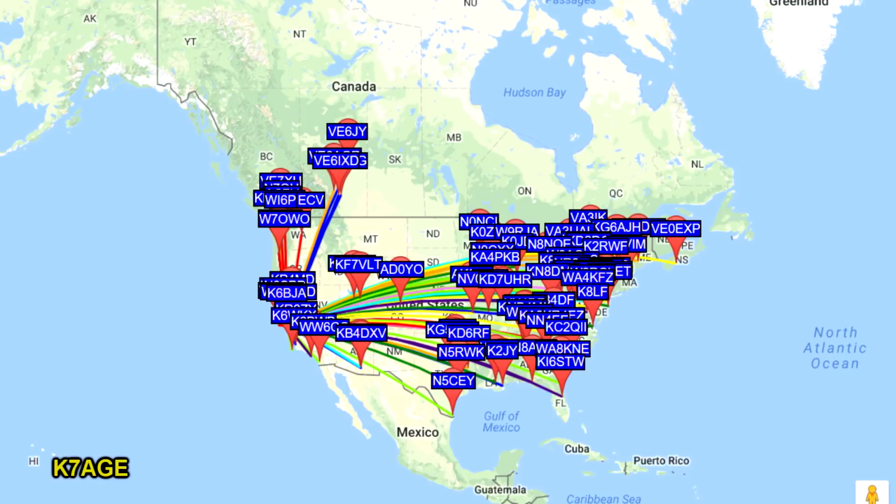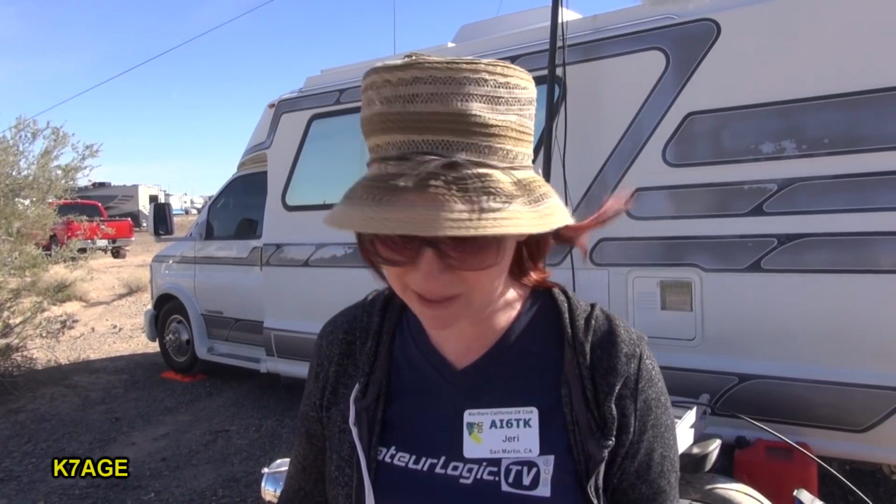We've been doing some WSPR side-by-side tests with, Amy picked up a DX Engineering loaded whip antenna, and we tuned it into 40 meters just to have a side-by-side to see how they perform. If I had my choice between a dipole at 40 meters up way in the air or a mag loop, I'd probably take the dipole. Yeah. But some of the stuff I do at home for 80 and 160, I can't get a dipole high enough in the air, so I take a mag loop every day over that.